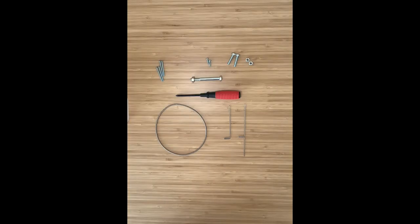I just used some metal snips. I should say my husband used some metal snips. And you're going to need as many needles as you have slots in your cylinder. So another way to put that is you're going to need as many needles as you have stitches for your sock. My machine has a 64 slot cylinder, and so I'm going to need at least 64 needles.